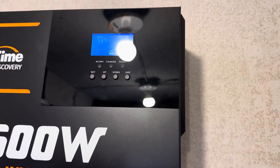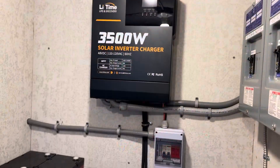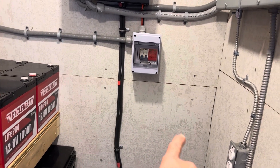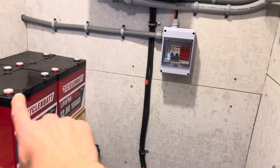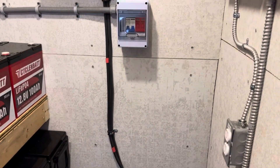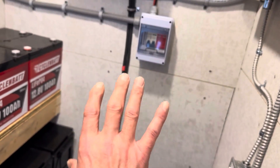Alright, enough pulling power out of the 12-volt — I'm trying to save that for other purposes. So I'll hit the grid breaker and it'll settle back down and stop charging. That's about all I've got done so far. I still need a battery combiner box to tie in all the batteries for the 48-volt system. Each battery will have its own breaker going to the combiner, with a common bus bar — the inverter will also have its own breaker in the combiner.